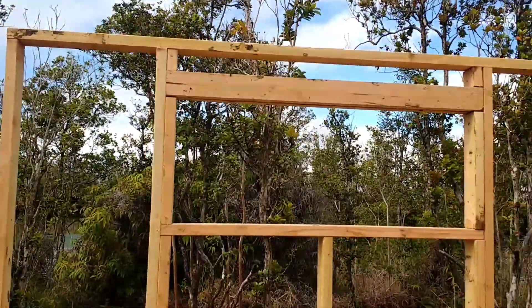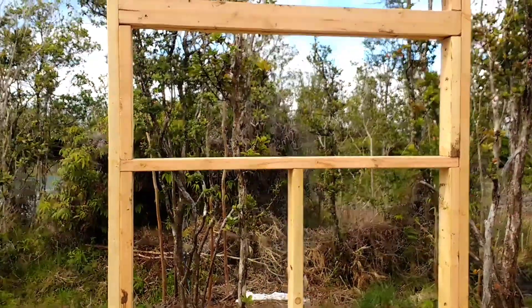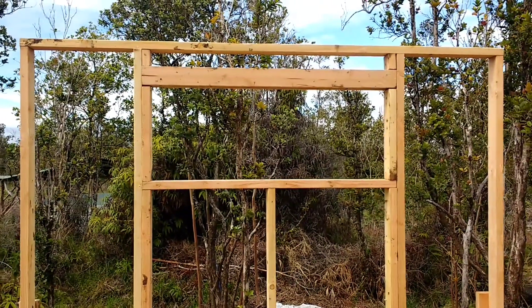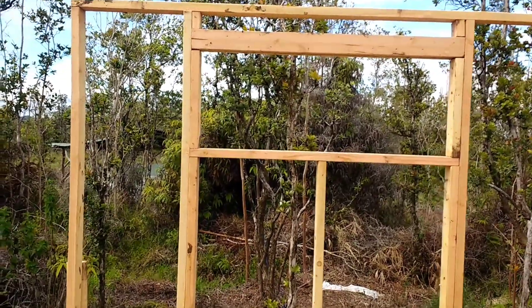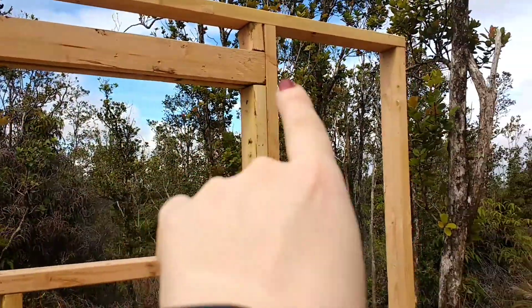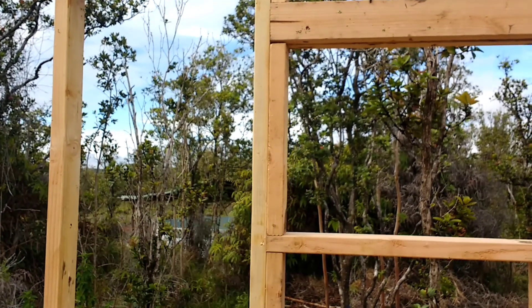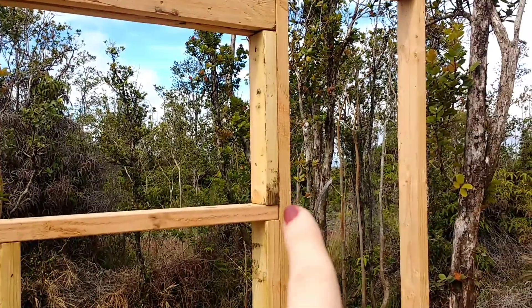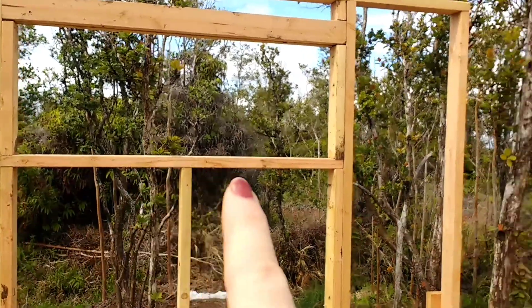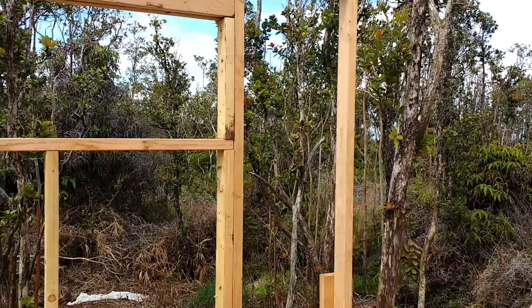Now that there's a wall there it might make more sense. So this is an eight-foot wall with a four-foot window in the middle. When it's done it'll be eight feet wide but only seven feet tall — the header will sit at eight feet and then the little roof on this bump-out will drop by a foot, so this is a seven-foot top rail. This section will have a shelf that runs all the way across right at the top of the window, then probably just a single shelf in between, and then another shelf that runs all the way across but just to the end of the window — so you'll have a shelf all the way across, a little shelf on this side, and a shelf that runs into the window but stops, so that this section won't be all filled up with shelves in case you need to put something big and tall on the counter.